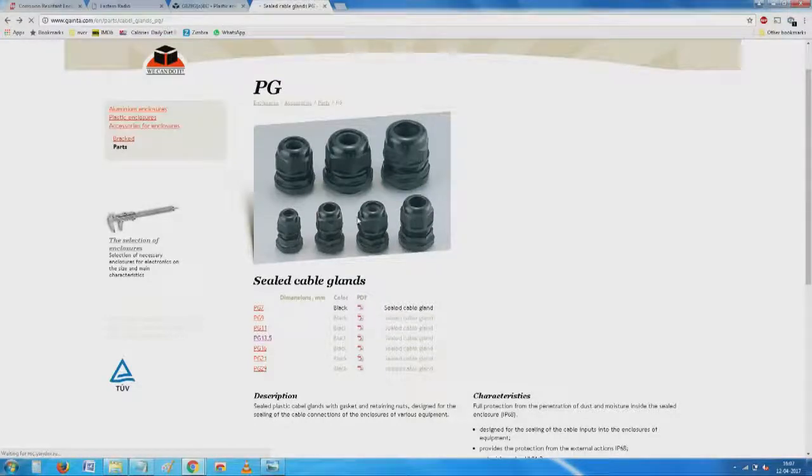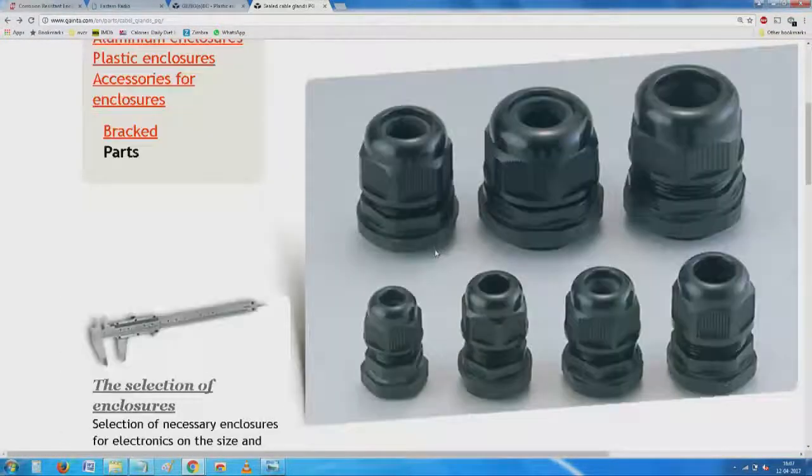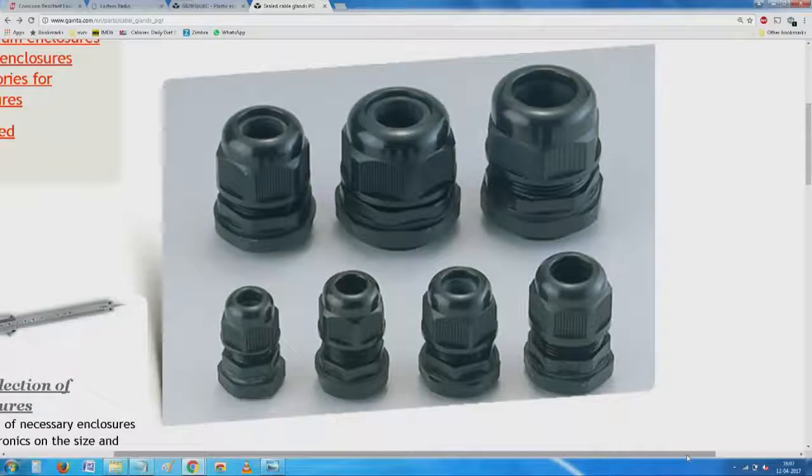You must learn to see. So, you see here, what looked simple there is actually a little complicated. There was a ferrule-like thing. So, as you turn this nut, that ferrule closes, and if there is a packing inside, it will go and grip anything you keep inside. It could be another tube, it could be a silicone sleeve, and inside that you can have your cables, and it is practically watertight.